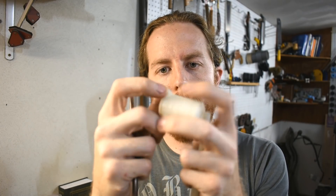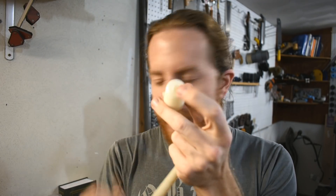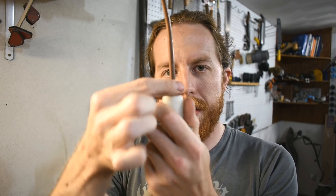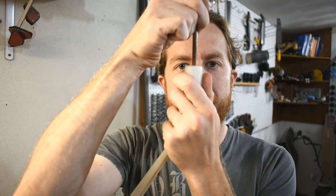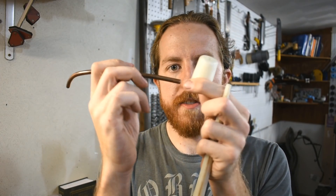By designed to work with quarter-inch tube, what I mean is the bottom of this has the same diameter as the tube. This, which is where the metal flows into the surge trap, is also the same diameter. And this hole on top can accept a piece of this tight in it to act as the vent when you're ramming it up. Then you can pull this out the top — or not, if it's too tight — then pull this out the bottom and have your sprue, your surge trap, and your runners molded nice and smooth without changes in diameter anywhere in the system.